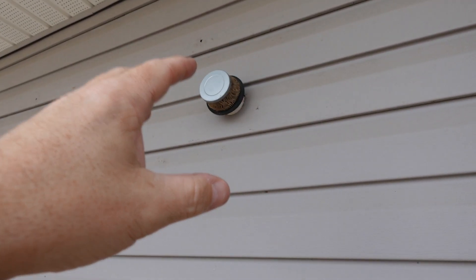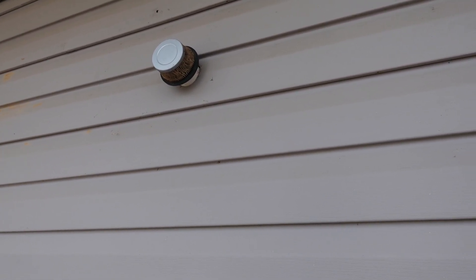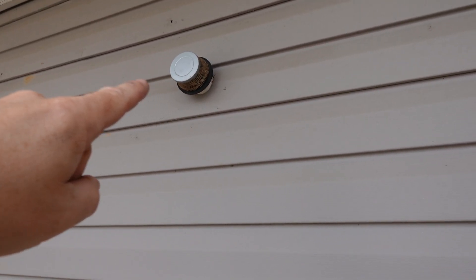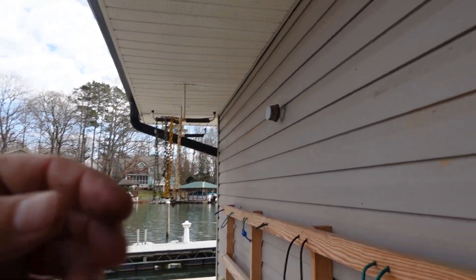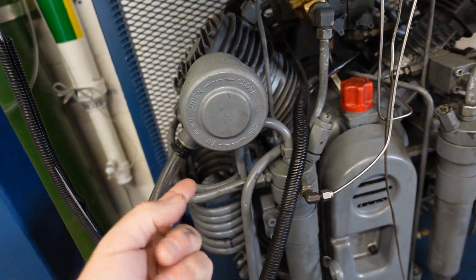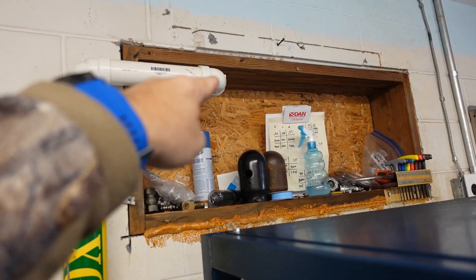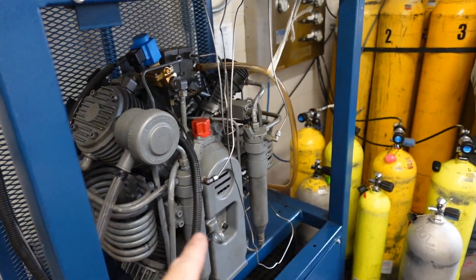Basically this filter keeps all the bad stuff from outside out — not chemical contaminants, but things like spiders, bugs, and critters that we don't want in there. So we're pumping the atmospheric air from the outside into the system versus pumping it straight through the intake inside where we've got bad atmospheric air. We are pumping the air from outside through the nitrox stick into the compressor.